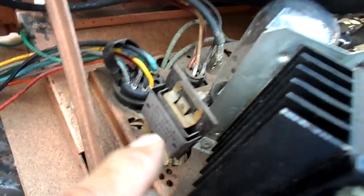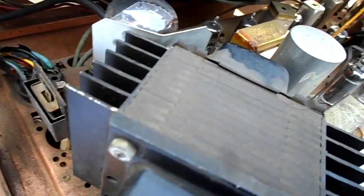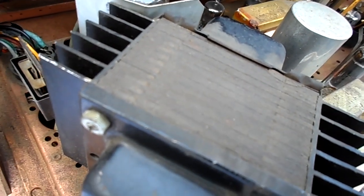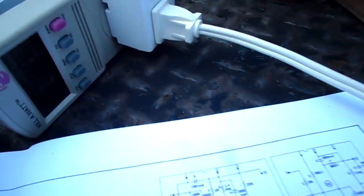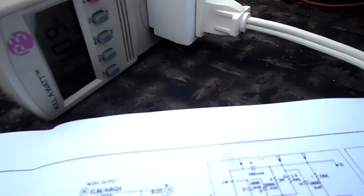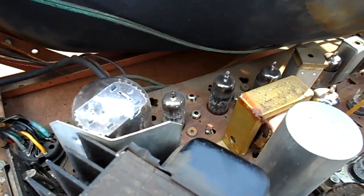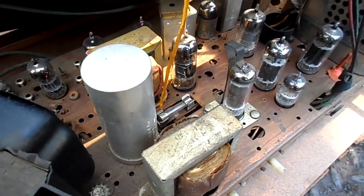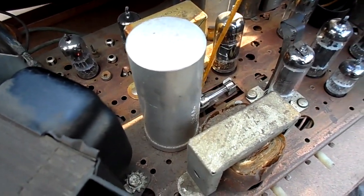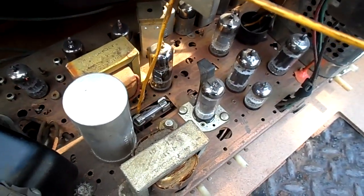I hear the little Motorola. This is their feature here — this holds the B+ off until the tubes light. It holds the B+ off the filaments, off the tubes until the filaments warm up. I'm going up to about 100 here. Now the kilowatt is coming alive — 112 volts, about 109 watts. I want some tube glowage here. Damn wind — you never have a nice day, it's always windy. I do see tube glowage. Fuse is still good.